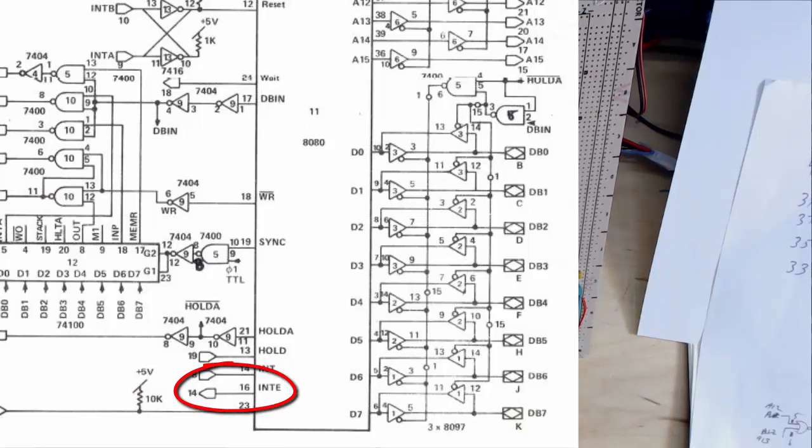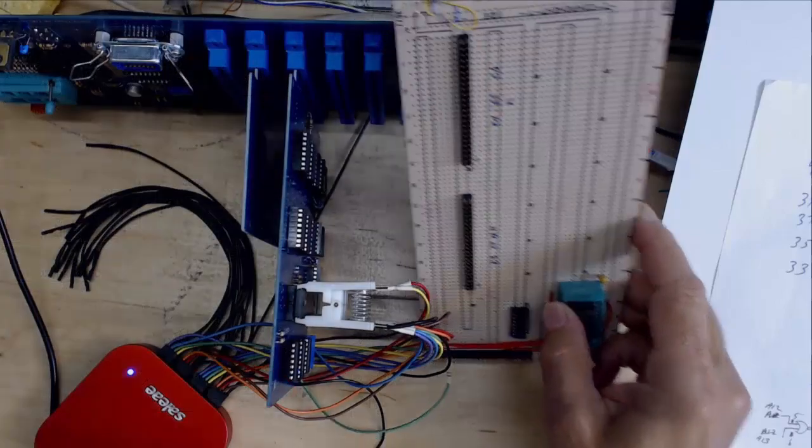And so using this little loop, I can see that as long as it's fetching instructions, I can watch it toggle that pin and see if everything's working okay. And that's kind of my first step to do anything. So anyway, I put that in my EPROM and was running that,